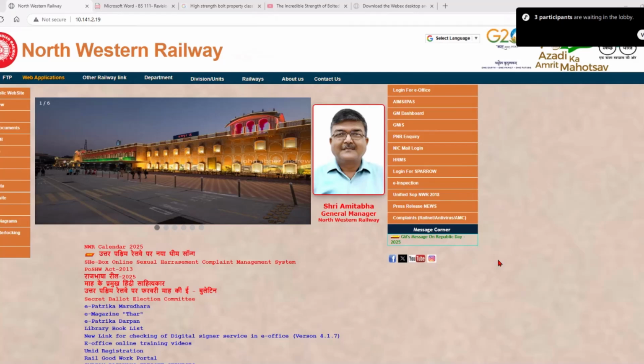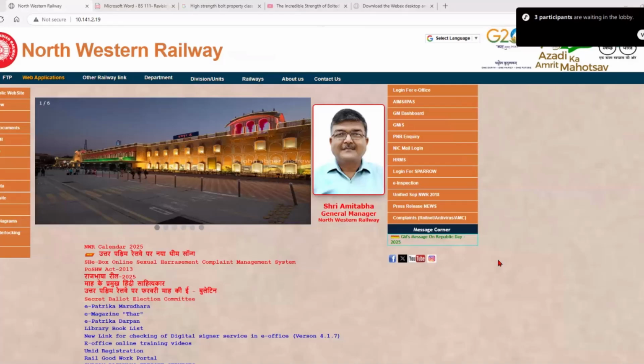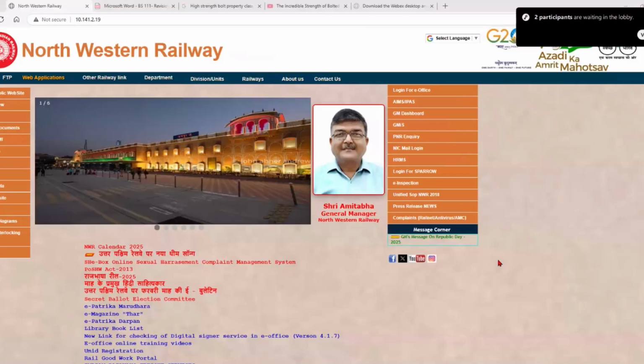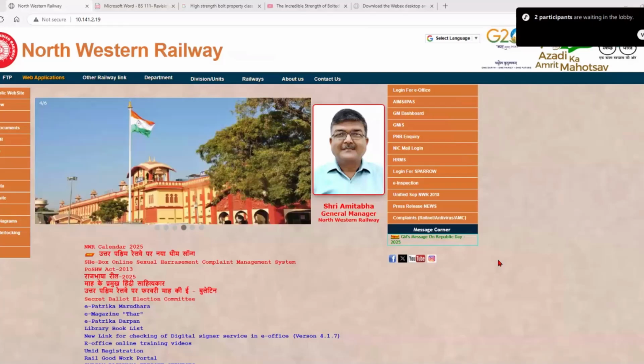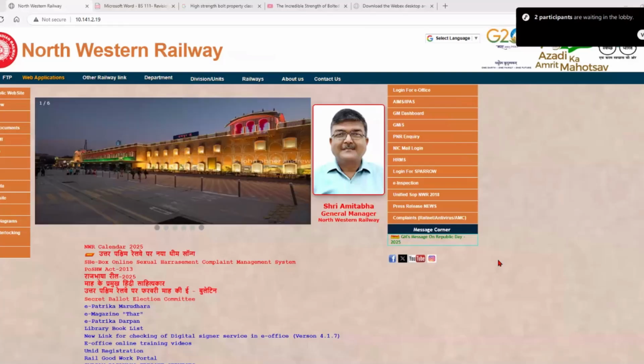But don't treat it as HSFG. DTI and all that are not relevant for that. It is only just a high tension bolt. Your axial force in the bolt will not play a part even for holding that, because a rivet will not come out in vibration or anything. Here you can put any additional, here you can freely use Loctite and all that, so that this nut doesn't come out. Okay, sir.